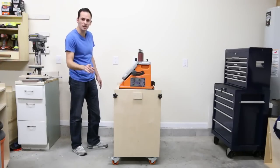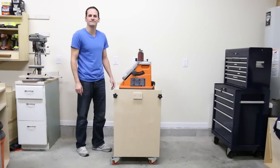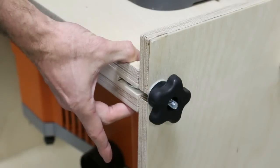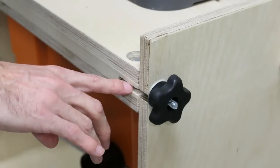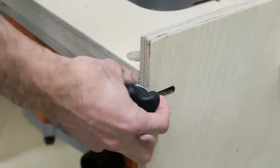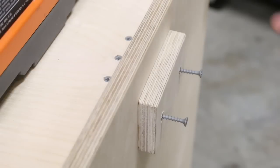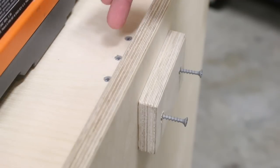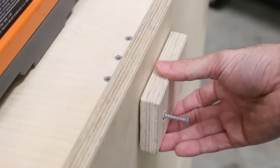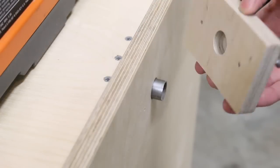The whole cart rides on 3 inch locking casters. The locking hardware is made up of an eye bolt assembly with a star knob and fender washer. A 3/8 inch bolt goes through and holds the eye bolt in place. The eye bolt is held into an open mortise, and as you loosen the star knob you can pull it out of the slot in the side, rotate the top, then pull it back and lock the top by tightening down the star knob. The whole unit rides on a 1 and 1/4 inch steel pipe that goes through the top and out the side, secured on both ends by a 1 and 1/4 inch screw drilled through the top and into the pipe. On the end it comes out 3/8 inch, giving about an inch and an eighth of total support through the side and into the pipe block.